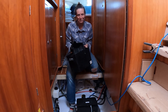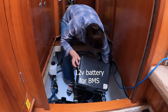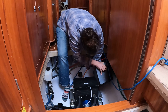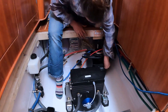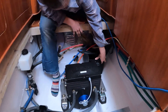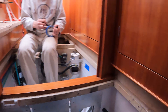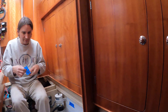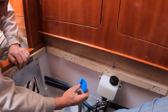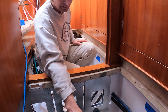So remember when we cut out the battery shelf? Now we have to find a new place for our battery. Is that really going to fit down under there? Especially if we get rid of the fan, there's enough room on this little shelf. We'll put the fuse block over here, and the ground bar over there, as long as we can access it above the battery or beside. That should be accessible there. And then that real fat wire going to the motor can just stop by the ground bar and then straight down to the motor.